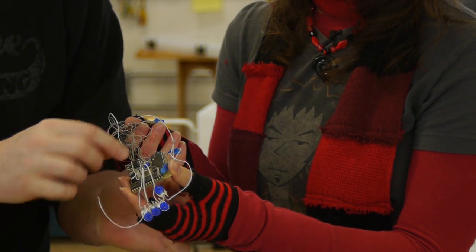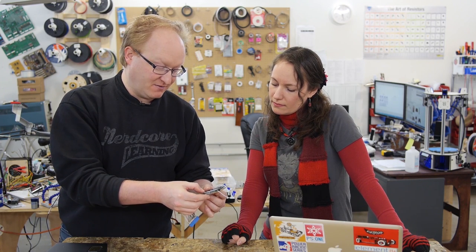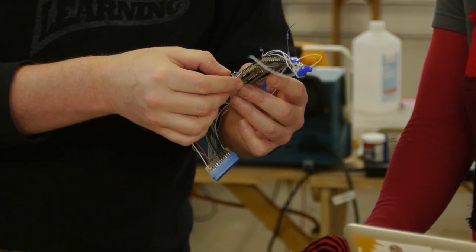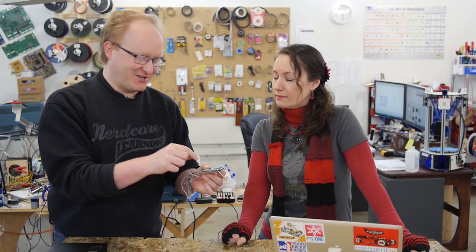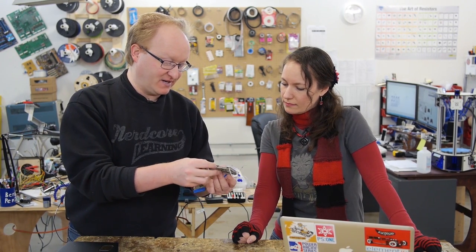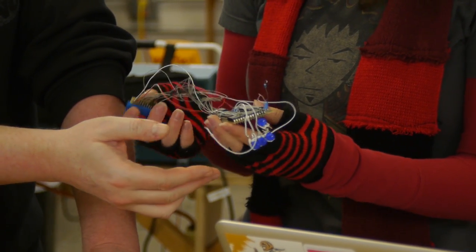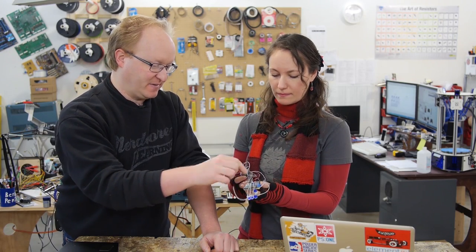So did you have any problems when you were soldering this? Well, it wasn't really a problem with the soldering, but I was using a surface mount inverter chip with the crystal to create an oscillator to go into the video chip, and I wasn't getting a good signal. I believe it was the type of Schmitt trigger on the NOT gate I was using. So I ended up using a larger through-hole NOT gate — I cut off the leads and put it with the crystal and it worked properly. So it was one of those things where I'm not going to spend any more time trying to get this tiny part to work; I'll use a slightly larger part that I know works. Once you get this all tested out, these are going to get tucked in here, and you'll clean up this rat's nest and make it shorter and tidier. In a future episode, we're going to draw this into the computer and show you our actual design process — how we go from this to a finished design. We'll also talk about the decisions we make along the way as to doing 3D printing, laser cutting, and CNC machining.